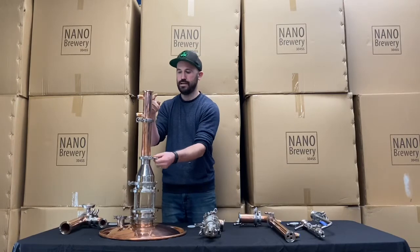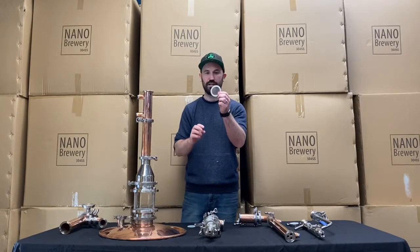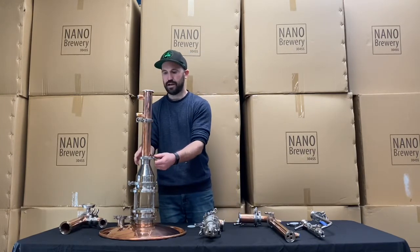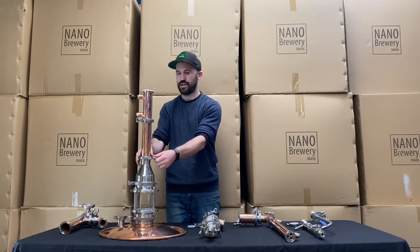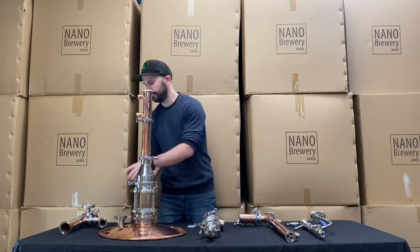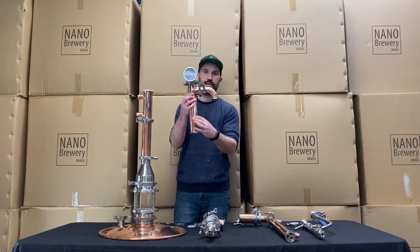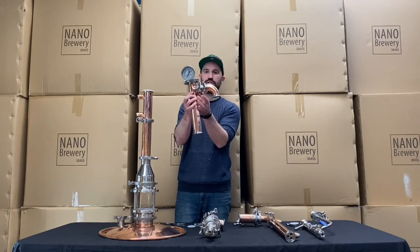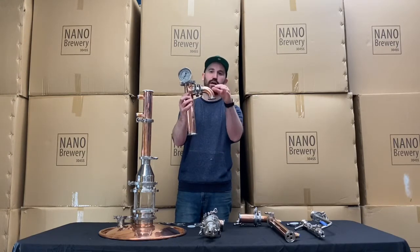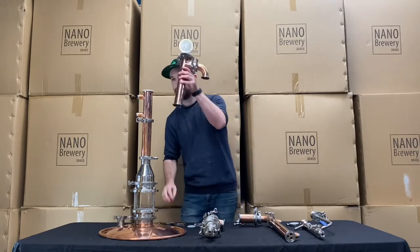Your reflux condenser up here — on top of that reflux condenser, you're going to grab your mesh seal, your beaded seal, and that's going to go directly on top. You don't want any packing media falling out of this section, so that's the purpose of these mesh seals. Now on top of that, we've got our linking piece — this L piece — with the dial thermometer on top. It's got a reducer: this L piece is two inch, reducing down to one and a half inch. Off that one and a half inch fitting, you've got this elbow — a one and a half inch 90-degree elbow.